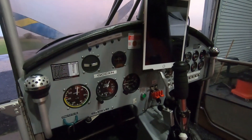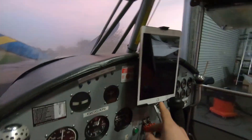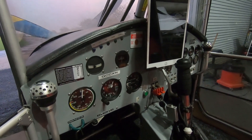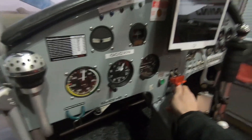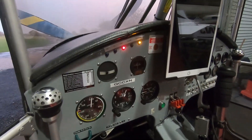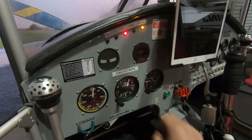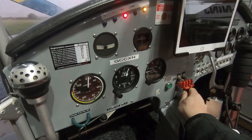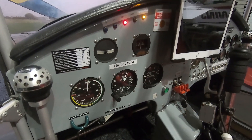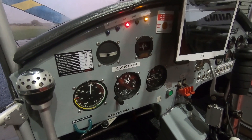Here's the new dash — this is what we did a full rewire on. We've fitted a RAM mount iPad holder which is fully adjustable. We've put in an ignition style key switch. That now illuminates the battery master and the charge light. The way we've wired this is so that should he add a lithium battery, if you rotate it to position one it will isolate the charging circuit so that you can't overcharge the battery whilst in flight.